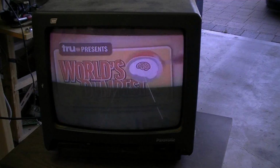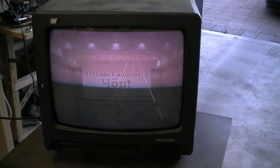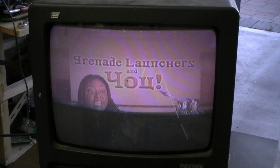So my TV is broken. Look at that. The picture's just jumping up and down, and it looks like crap. Yeah, the reason there's half a picture here is because these video cameras now automatically select their shutter speed based on how much light there is, and this being a CRT set, it's actually catching the scan mid-scan.